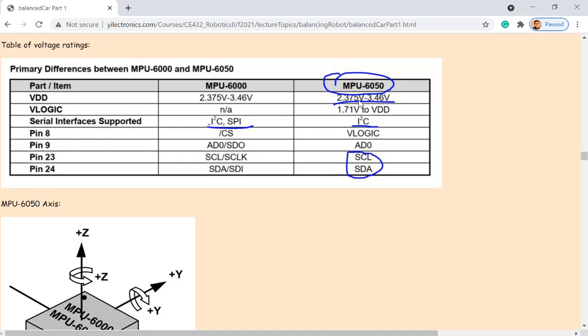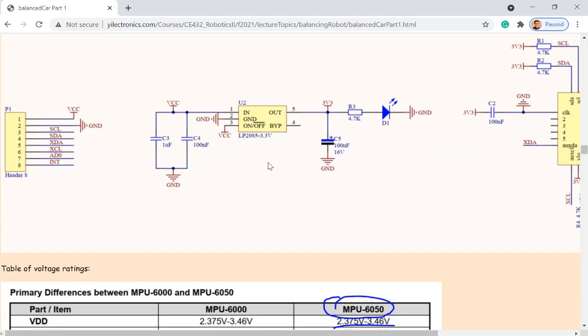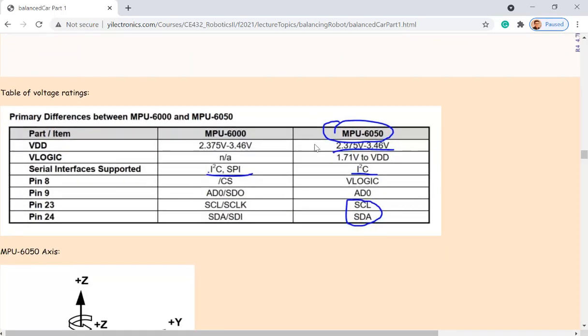So it's a 3.3 volts component. I have to use a 3.3 volts regulator. I have a lot of these chips in my drawers. I think it's this guy, right? I have to design a circuit for this regulator to supply that 3.3 volts to the sensor.